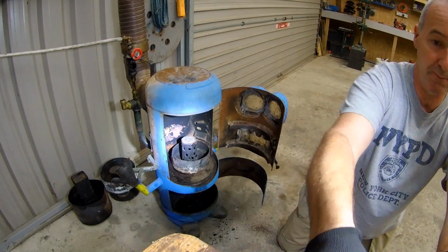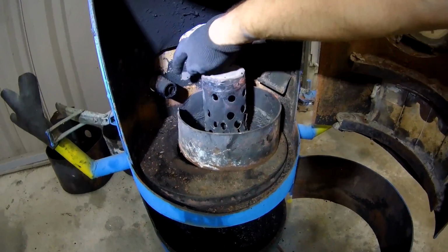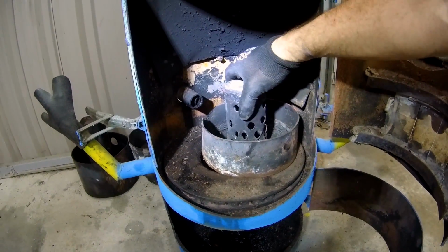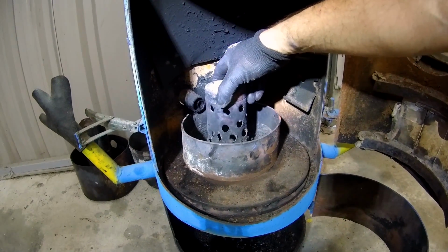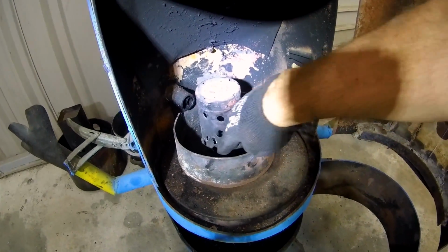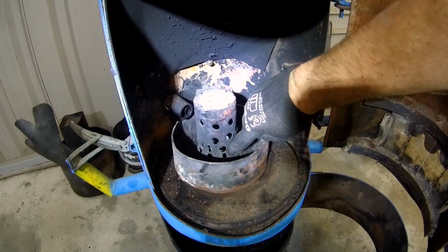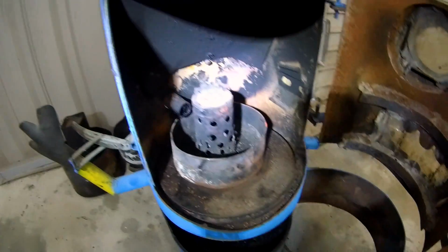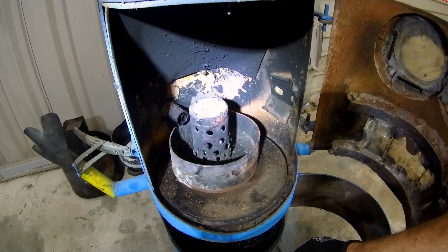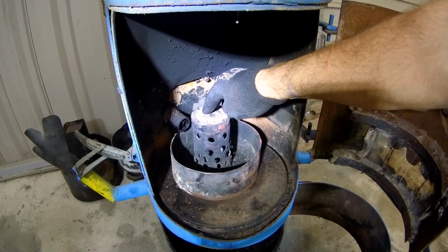I'll just show you this. So my oil comes down this centre one. Not that it's overly centred, but my oil comes down this smaller pipe and drips in here. Air can travel around the outside of that if I let it. So I just put that under there, and that's it. And the oil just drips in here, and air to feed the burning comes through these holes. Now, it's not necessarily mission critical as to the placement of the holes, but essentially they're an inch apart all the way around. And this is prototype 3 or 4, and it works really well. I'm not saying this is the final design, but it's actually very good. It works really well, and you'll actually hear the roar of this thing when I get it going.